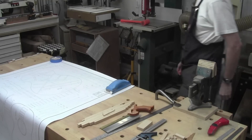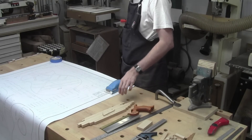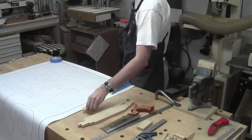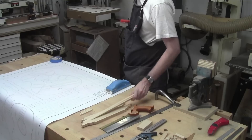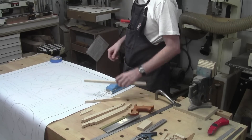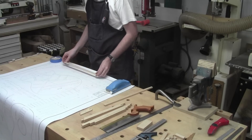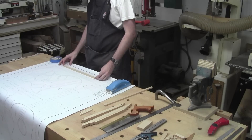With everything radiused - probably didn't need to radius the tiny things, but that's okay, we did it. The first thing we're going to do now is get the X-brace cross worked out. This is T6, and it's a half lap joint at a diagonal. What I'm going to do is put it on the full scale drawing here and use that as my guide. Those radiuses came out perfect - very nice. It's a cross lap, so it's notching on the bottom of one and the top of the other to get them together. I need to mark them so I can cut them. I want to use my marking knife.